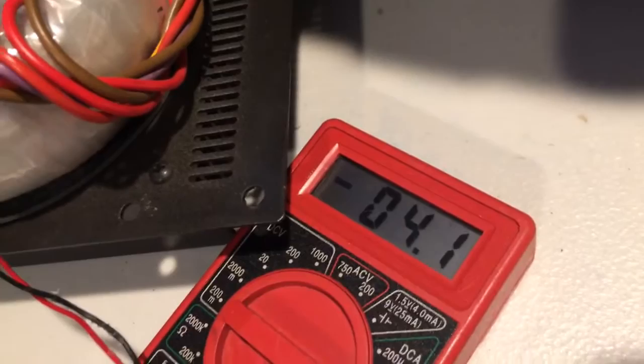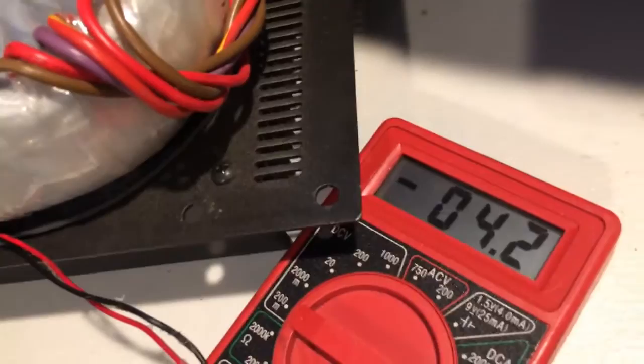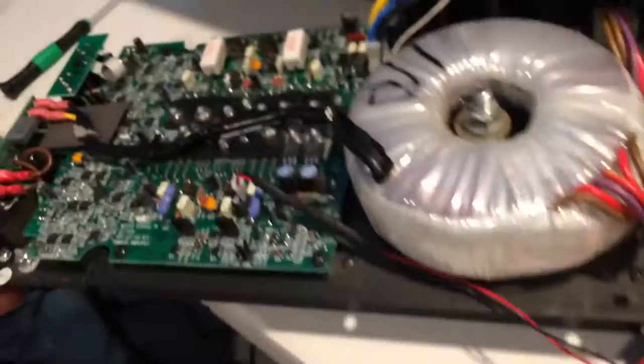Going in here — you can see we're rising up to about 2.1. That screwdriver's way too tiny. These are flat-head here. As you can see on the meter it went up to 3.9 — now we're a little high. Just tiny little bumps... there we are, 4.2. See that? That's where you want it.